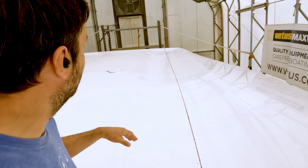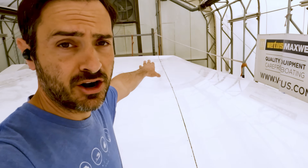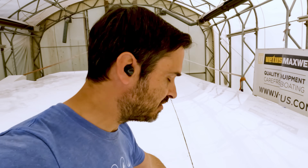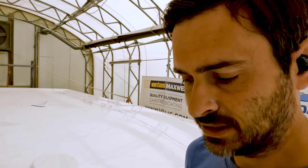This area, of course, will not be non-skid — that's where the traveler goes. And the aft there, all the way back at that beam, it's going to be actual gel coat too. So those are the priority spots; the rest of it is going to be non-skid. But now we've got to sand off that gel coat and get a level surface, and then I have to do the same thing from the underside — clean that all up and get it ready for glass, hopefully this week.